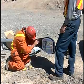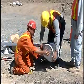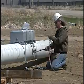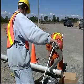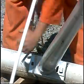At this time, the pole can be pre-wired. When working with a larger crew, the augering and pre-wiring can be done simultaneously to save time. Using the fish wire provided, run the power cables through and install arms, luminaires, or brackets while the pole is still resting on the ground.